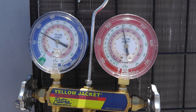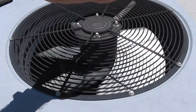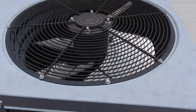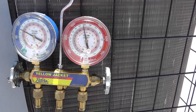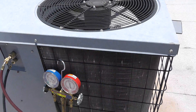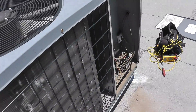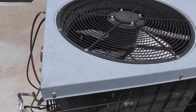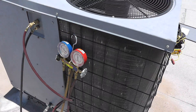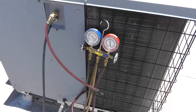And then how we get superheat and subcooling, which are two really important things that are going to tell us a lot about what's going on with the level of refrigerant. Because this will basically tell us what's going on temperature and pressure-wise with the refrigerant. But we've got to go ahead and get inside the unit, get some temperature clamps hooked onto the suction line and liquid line positions to get the liquid line temperature and suction line temperature to give us superheat and subcooling. And that tells the whole story, folks. That's what it's all about — superheat and subcooling.